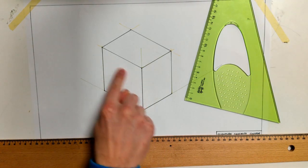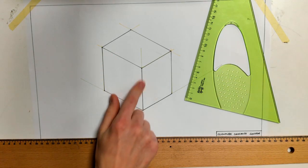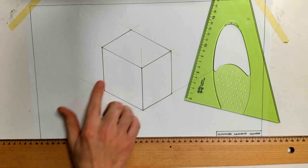You can see at the front elevation of the coffee table there's a hole in the middle of it, it's hollow. It doesn't tell us the measurements for that cutout, but if we count across, there are small grid lines all across the table, and there are 4 little grid lines across the 80 millimeter wide table. So we divide the 80 by 4, which gives us 20. The cut takes up 2 squares, and it's in 1 square from each side.